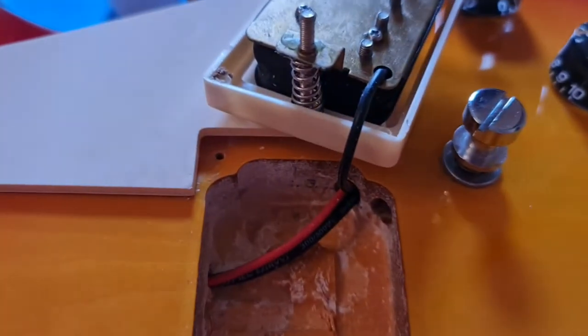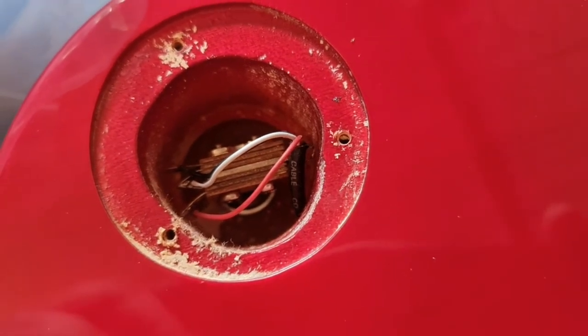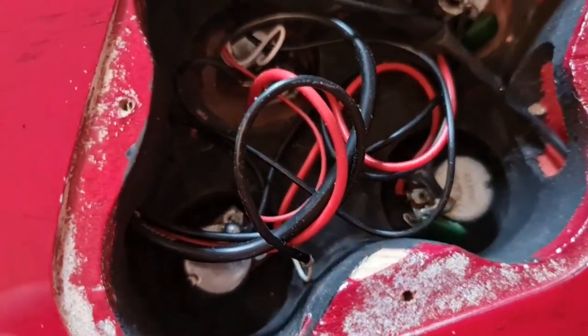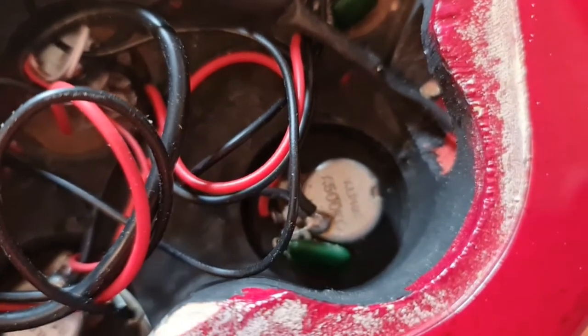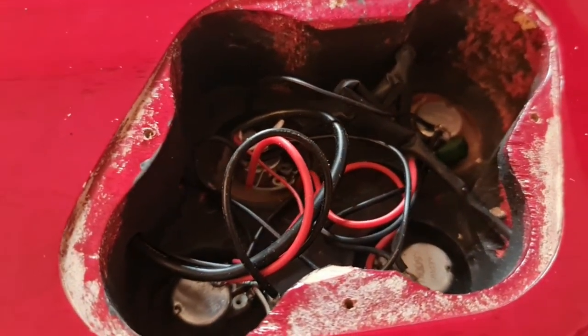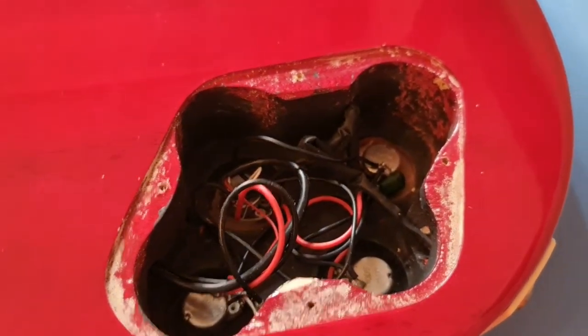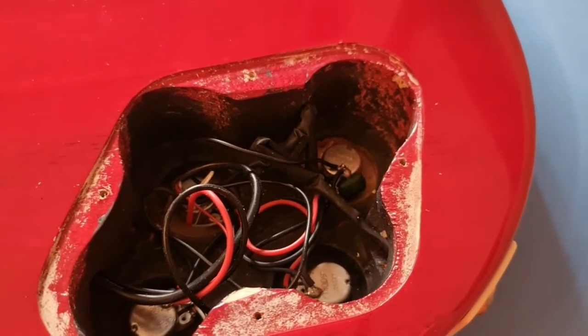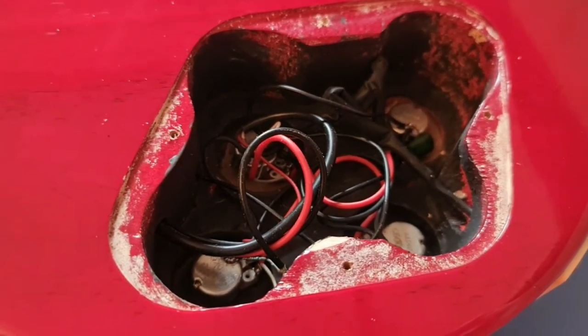You do that just by undoing the four screws around the white pickup rings. The electrics on the switch are absolutely perfect — all checked. There's the other cavity — mini pots, just cheaper, that's all. It looks all right but there's a wire off down at the back. That just needs a bit of soldering and that'll cure the problem with the tone knob. All the solder points look quite tidy. Probably over the years that's come off — maybe a dry joint from moving about, who knows.